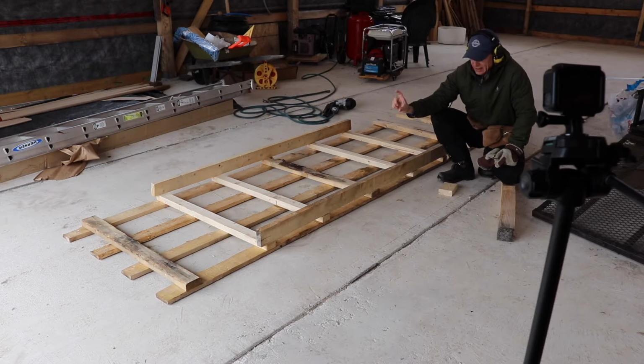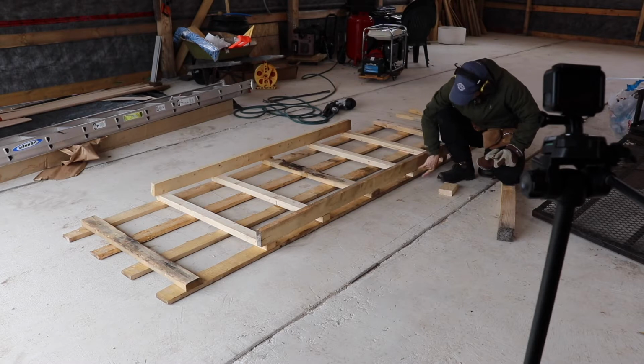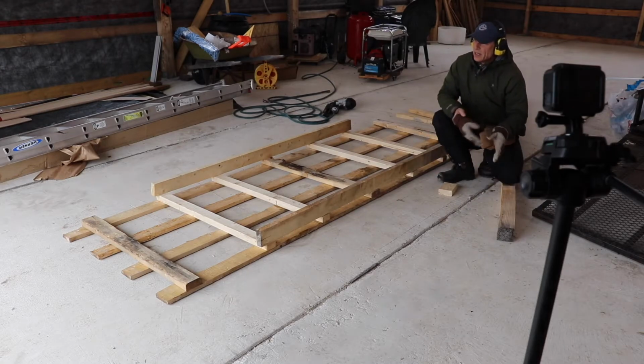So when I take the length of my caster wheels into account, that I've already got the dimensions for, the 1/2 inch for the plywood top that I'm going to add, along with the depth here, which is 2 3/8 inches, I add all that, subtract it from 36, and end up with 28 3/4, which is what the length of each leg needs to be.